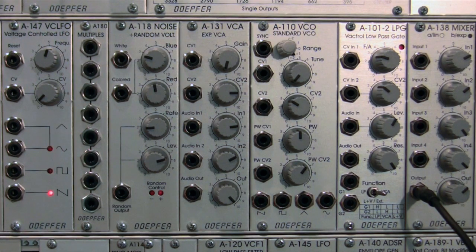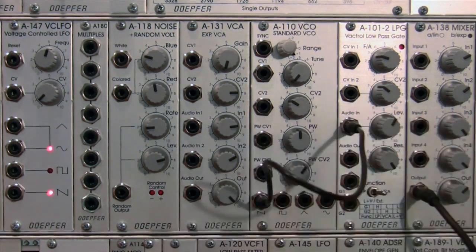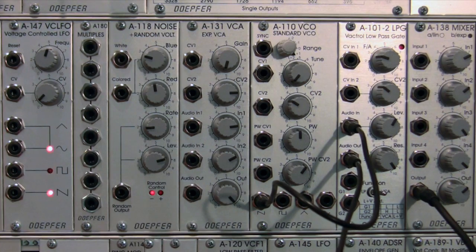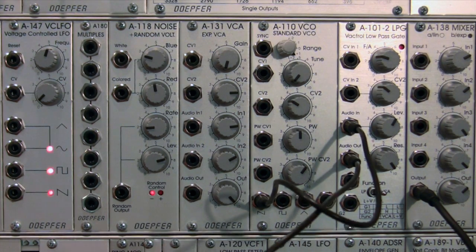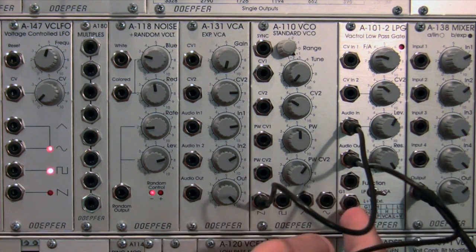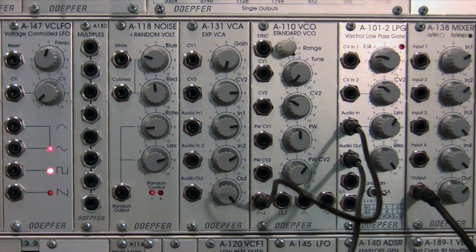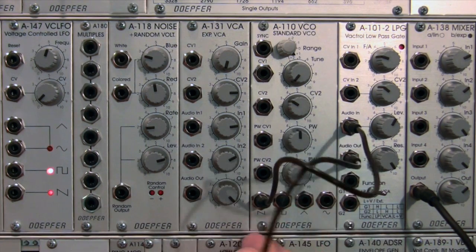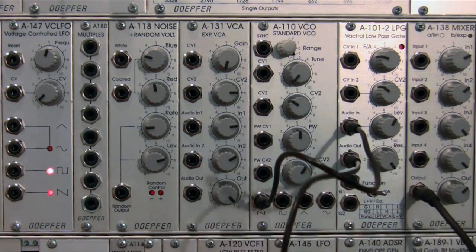And now that we have an idea of what that sounds like, I'm going to let you now hear it through the amplifier. So let's take our signal, saw wave, and then patch it into our audio in here. There we go. And then we're going to take the audio out from here into here. Now, one thing to note about this is we're not going to, for the most part, hear that much of a tone color change. Because that's one thing VCAs do not do, is change the tone of your signal. Although that could be argued, you know, the electronics within these modules do to a certain extent sometimes act as a coloring type device, so to speak. But for the most part, the frequencies from the original signal should be retained when you go into your VCA and then out to your mixer.